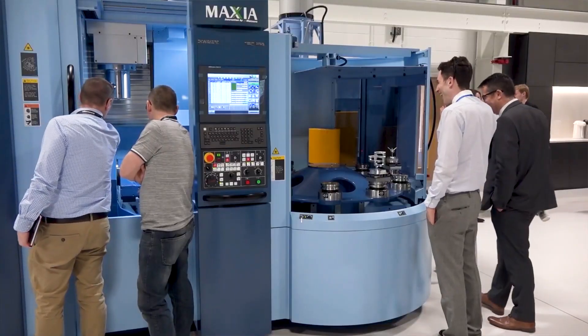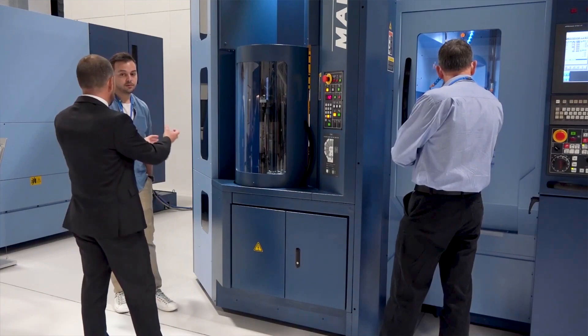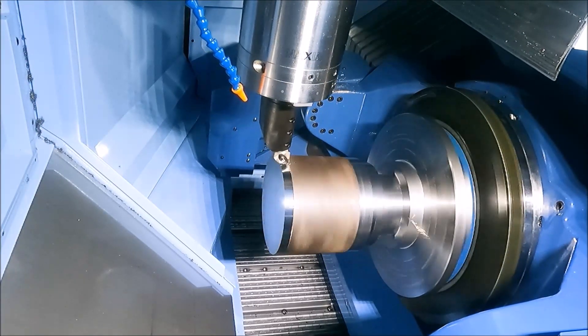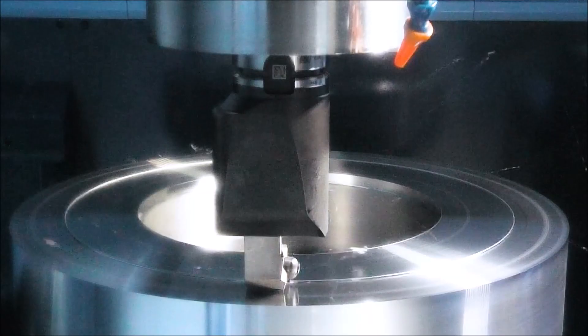There's an open house coming up at the end of the year. November is a fair way away, but we have a key new product we're launching — a development from the MX520 behind us. Towards the middle of the year we're going to be holding stock of the machine that has full turning capabilities and now up to seven pallets. With the MX520, we are targeting a slightly different audience — the machine has 500 newton metres of torque on the table at 800 RPM, designed for machining much harder materials and larger diameters at lower cutting speeds but with massive torque.